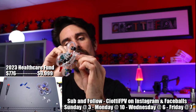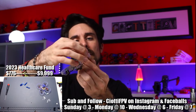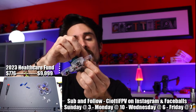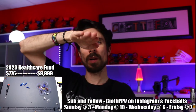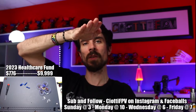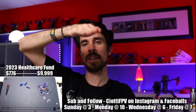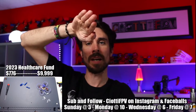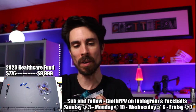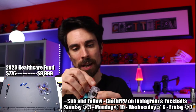The problem with them is that the reason why they perform so well is that each propeller blade is very thin. And they're at an angle, and when you pull up on them, you'll change the pitch of the blade and you'll bend it up. And then it's impossible to get that pitch correct. So now you've got one blade that has a jacked up pitch, and that makes them vibrate really hard. So this Azzy prop here is now ruined.